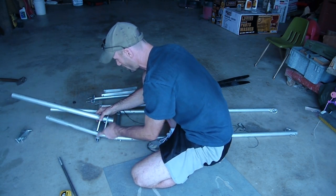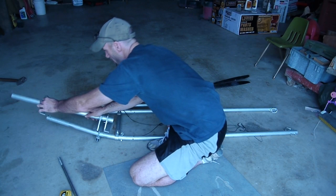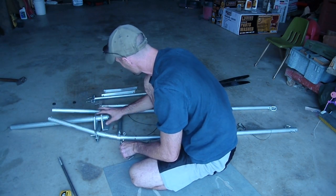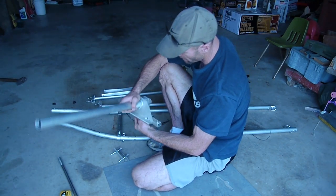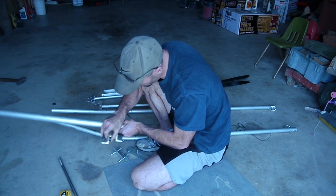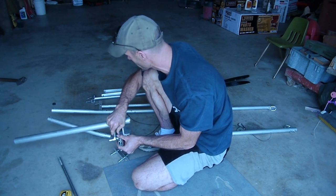I'll do this on the video. This bolts into the frame here to keep it in one place. I like it being one solid piece because it kind of keeps it in place. And then I would take these pieces here — this is going to mount this here, so that would slide through and mount over here. These are three-eighths bolts that I'm using here to mount the prop shaft. Also, when bolting this in, this is the piece that bolts it to the frame. When you mount that, you want some sort of shock absorber in here so that as this vibrates and moves, it's got some sort of shock absorber between the edge and the mount. And you'll see that when I go through and put this all together.